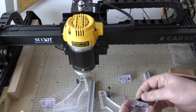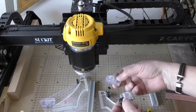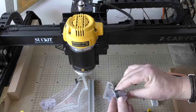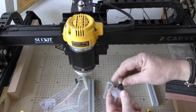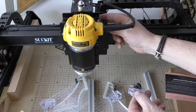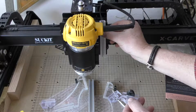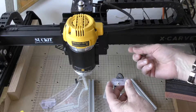When you get it, you'll have all these pieces. There's this piece here — you'll have a bunch of these support pieces, and these are the supports for the arms of the dust boot. You're going to look for the one that has a slot in it. There's a little black thing in there — you take that and slide it in the slot. This is actually where your Z probe is going to go, because the Z probe goes through the wall that supports the spindle, and you can't put this plate over top of there because it will block access to your Z probe.